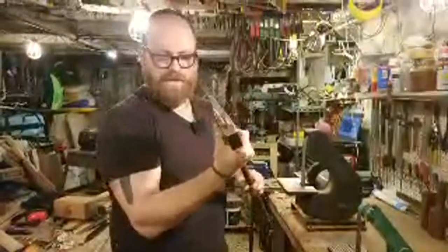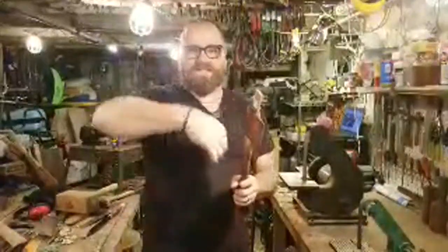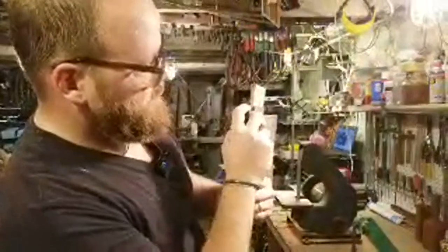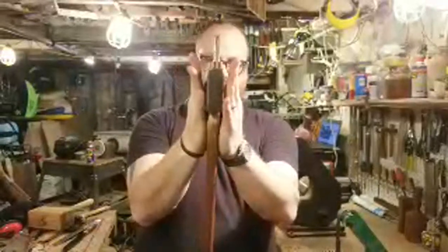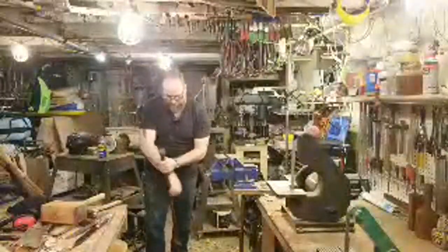It's a nice solid head, so I'm not too worried about it. So that should work really well. The glue will help that wedge stay in place, so it shouldn't back out. And you can see how much wedge I have in here. It's pretty thick. Before that was space, there was pretty much none there. So it's really pushing out on this. I might give it just a little bit more to get that mechanical hold, to get that mushrooming on the top. See if I can get maybe one more shot.